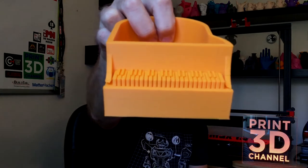I'm pretty impressed with the way the keys look — they're nice and clean. There are a few little retraction spikes on there but that's normal. I did use lily pads all around the model to hold it down because it was about a 12-hour print running at only 45 millimeters per second. There is a lot of detail on the model so it needed to capture all of that.